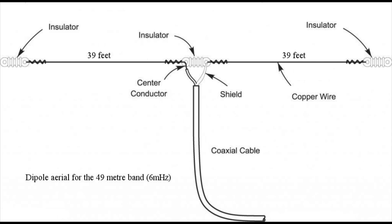So that's it — each length of wire goes out, the whole thing is horizontal, the whole 78 feet in a straight line if you can get it in a straight line. Doesn't matter if it's a little bit bent. For example, one end could be up near the gutter on the house, the other end could be a pole or a tree down the garden. The coax will hang down from the middle and goes into the house. When the coax gets to your radio, the braid — the shield — goes to the earth socket on the radio, and the inner, the centre conductor, goes to your aerial socket. Assuming the radio is working properly, on the 49 metre band you should get brilliant results.